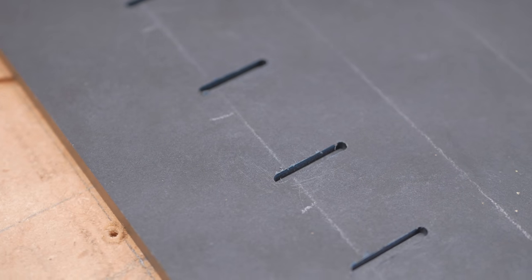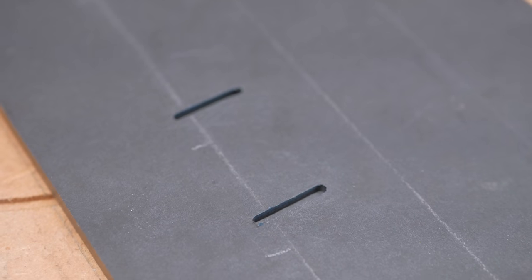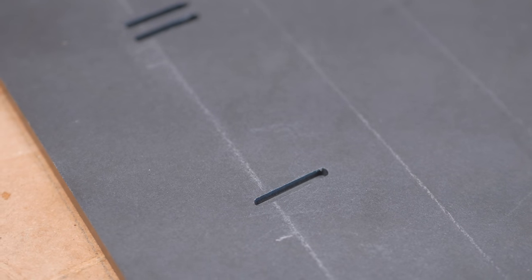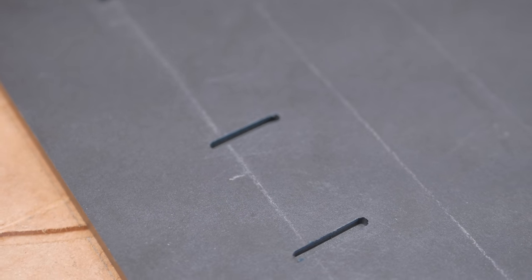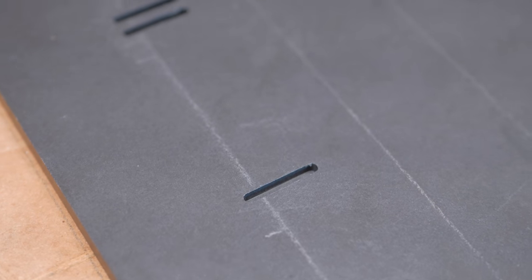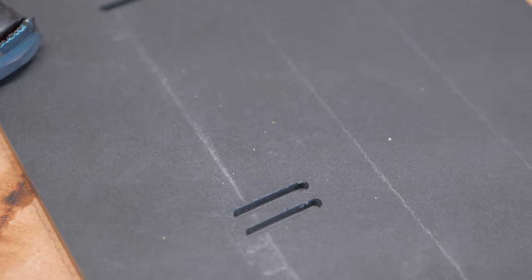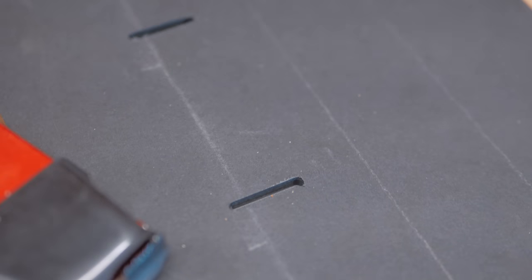These are the type of inlays that are both the top inlay as well as the side dot. So you see my pencil line, that's the edge of the fretboard, and I'm going beyond it. So when the contour shape is cut, you'll see a little sliver of side dot. We're just going to mix up some epoxy and fill this up. Let it dry overnight.